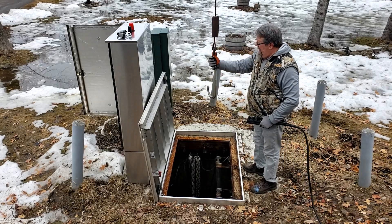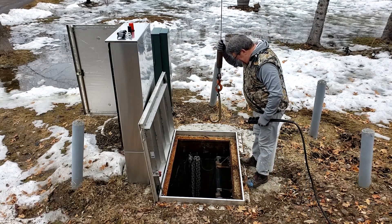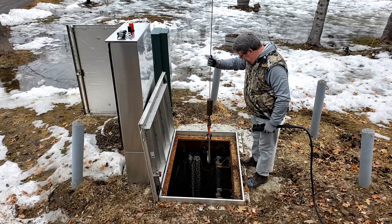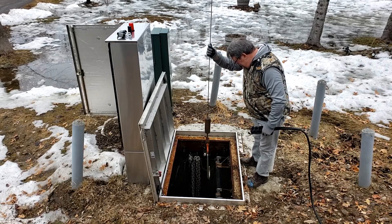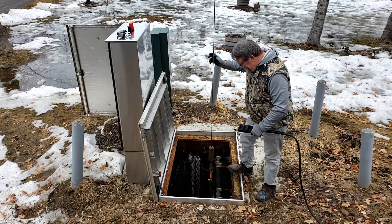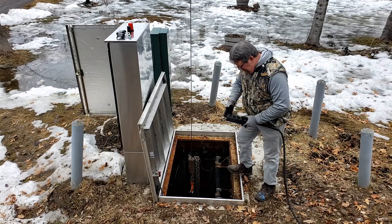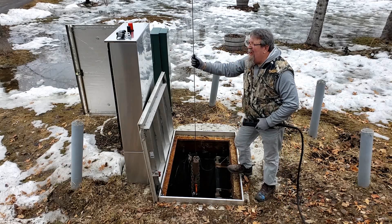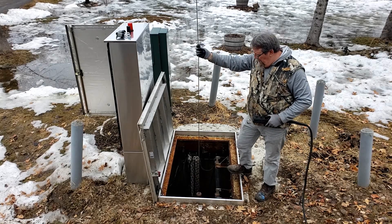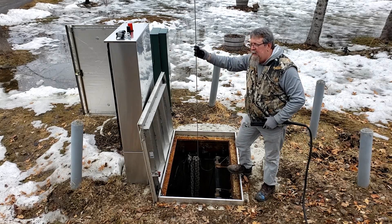I'm going to set the pump down and hook the top of the pump, and we'll lift it out of there and pull out whatever is wrong. Today is just a clean day. The recording software is showing me that I have one pump that's running three or four times more than the other, so that means it has some form of blockage.